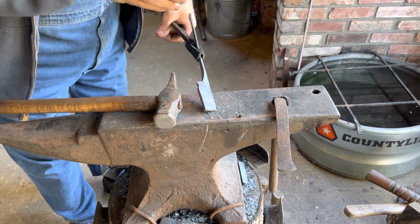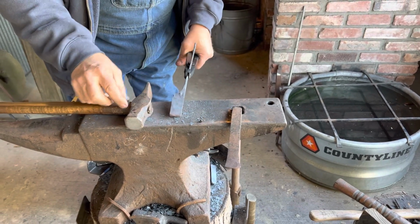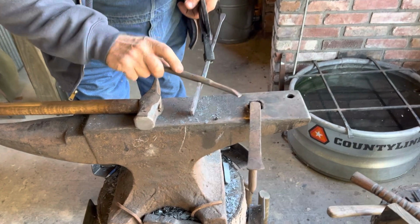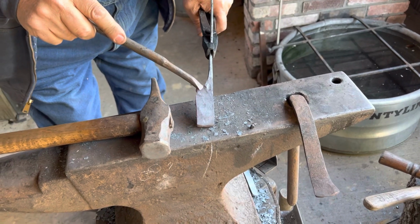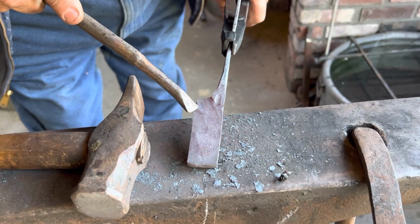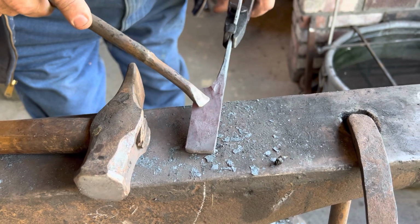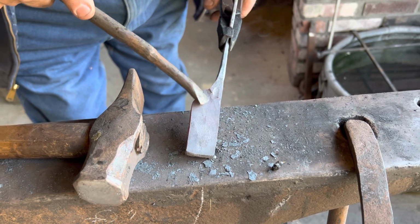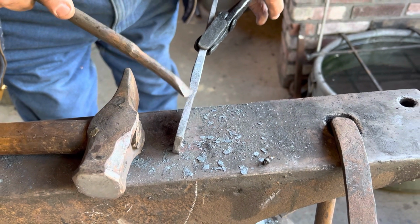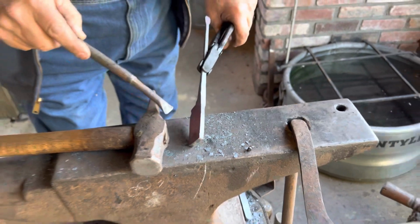But you see it, I'll go back and redo this with the vise, and then redo this using my hold fast in that little bar I've got made. The little one here, the big one here. And that will continue to not only push in, but this will pull out. So we're doing two things. We're pushing this in, and pulling that out. And only when we get all that accomplished will the blade start getting to its target thickness right here. That's your target thickness for the blade, and then it carries on out.